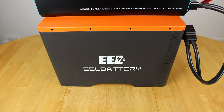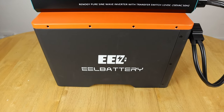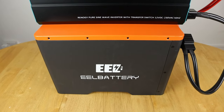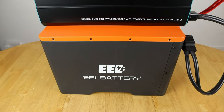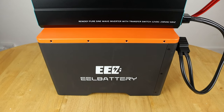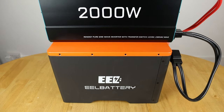I'll also cover more on how these batteries should be charged, because I've had questions on how you can charge them from mobile to home use. So I'll be covering, or trying to cover, DC to DC charging. Renogy have got a couple of offerings in that camp, including MPPT solar charging as well, if you've got a mobile setup. So I'm going to look more into that. Also, just attaching an MPPT solar charge controller directly to the battery, and also finding mains charger options.